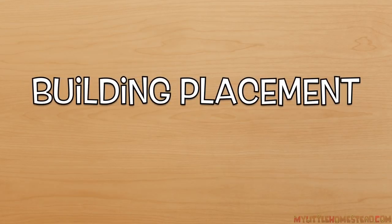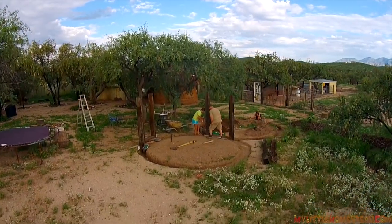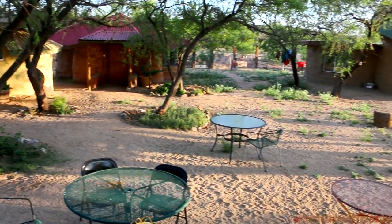Today I'd like to focus primarily on what we do for foundations to get things started — how do we lay things out? When anyone sets out to do a structure, consider where the structure is going on the property. Ten acres? You've got a lot of space. But if you have a smaller, like a one-acre plot, how far away is it from the neighbors? How far from the fence lines? How far from the pig farm that smells really bad down the street? Also, which way you're allowed to put that structure — you may have to have that front door pointing towards the street. Those are the kinds of things you need to consider when you're plotting the placement of your structure on your property.